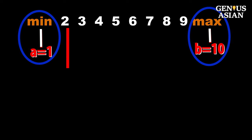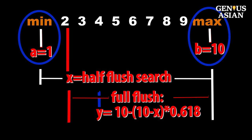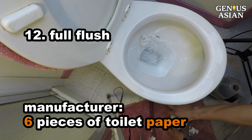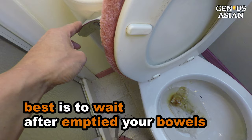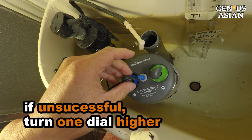Our half flush test for our toilet was 2, but for you, say it is x. For the full flush test, if we use the golden section again, the search range should be from x to 10, and the starting point is given by the formula. However, since we know a little bit more, we can cheat: we set the full flush one dial higher than the half flush. The manufacturer recommended dropping six pieces of toilet paper in the bowl — of course, the best is to wait until after you have used the toilet for solid waste. Push the lever down to perform a full flush. If it is successful, stop — this is your full flush. If unsuccessful, turn the setting one dial higher. Our best result was dial equal to 3.